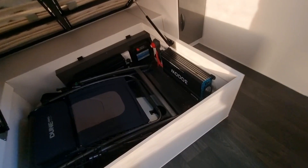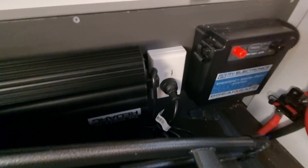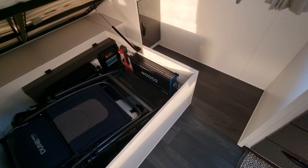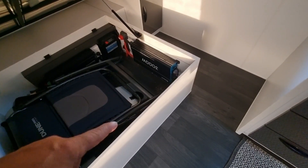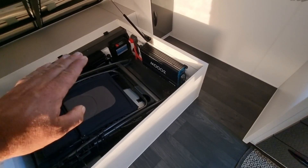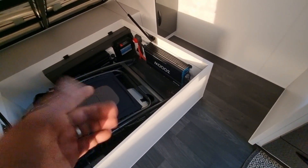There are a couple of simple things I need to do as a result. When I turn the inverter on off-grid, I need to turn off the charger. That power point supplies the 240V charger which charges my battery. If you're running on an inverter you don't want to pull power from your batteries through the inverter, then back through the charger — that's a loop. So I simply turn off the power point to the charger when I'm off-grid. That stops the drain. Easy — I can live with that.